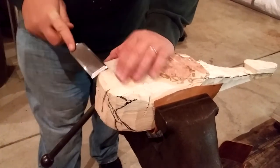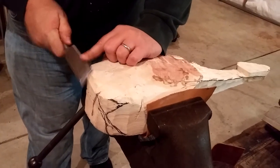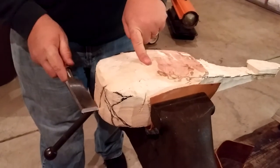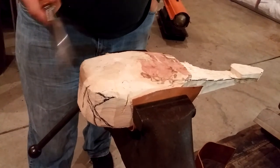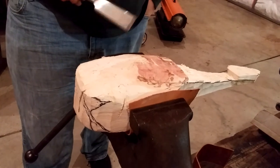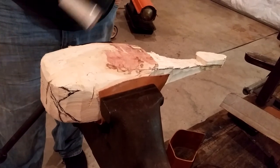You can take little pieces off very quickly, and sometimes you get a good cut like you would from a planer. So that's what I'm doing now — taking this point down to this point. Could you use a hammer while doing that to take bigger chunks off? No, at this point you really risk doing damage to the wood, splitting it, which I've already done on the outside.